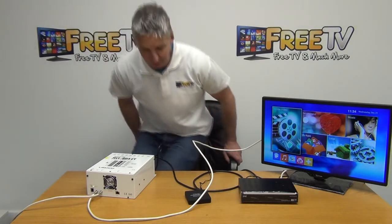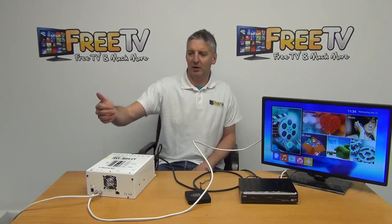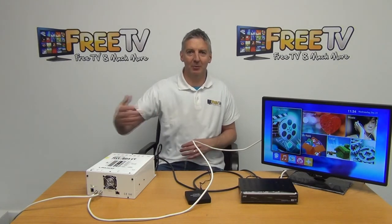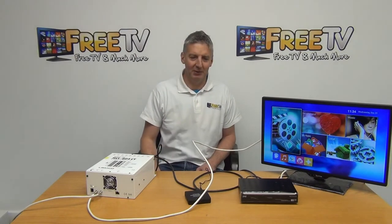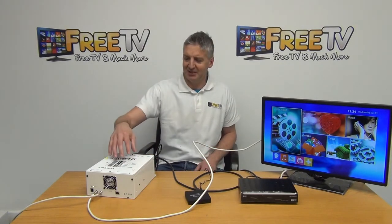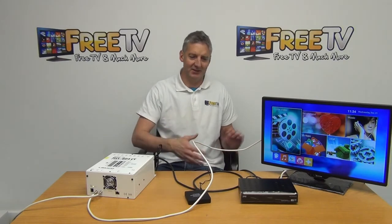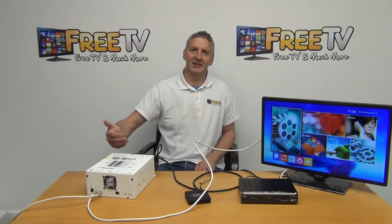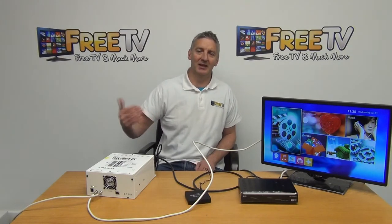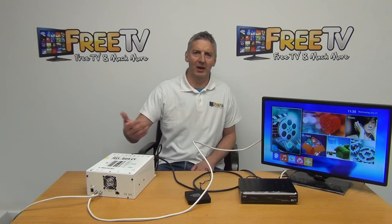Overall, this worked extremely well. The other videos in this series will include an overview of exactly what this type of head end is for, and we'll also cover the whole web interface — setting up output frequencies, changing LCN settings, and all the rest of it. This is super decent kit. You can imagine how easy it is to stack these units — what a neat solution. How many televisions can you send it to? It's really limited only by the size of your distribution network. Something like this can be retrofitted to an existing system — if you're distributing analogue signal, you can switch straight over and now distribute digital directly to the digital tuners on your TV.